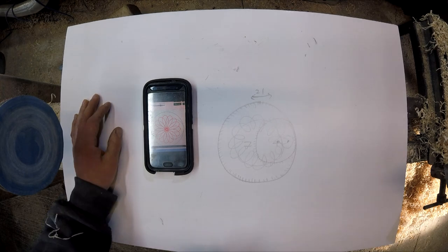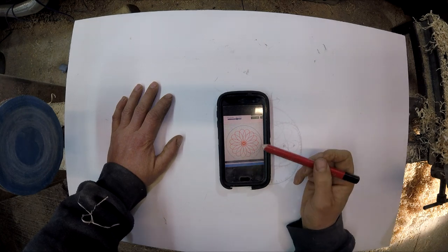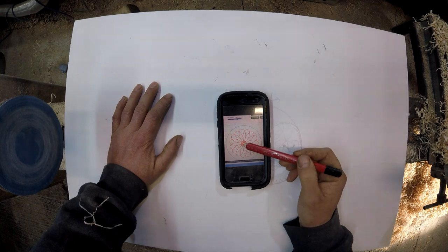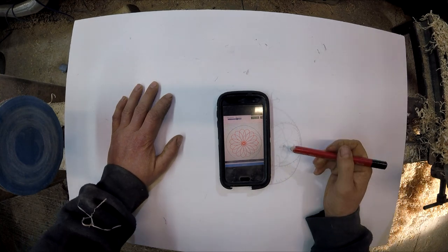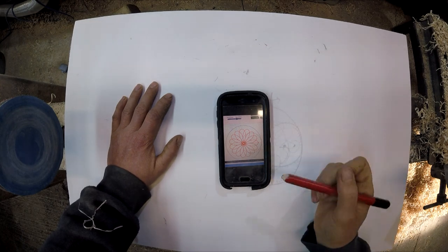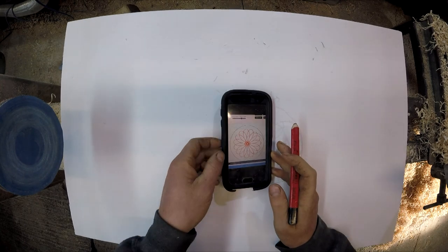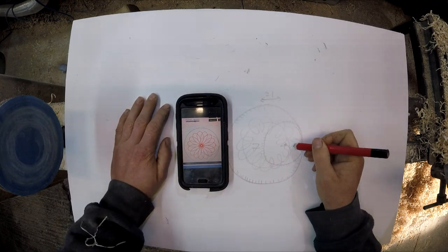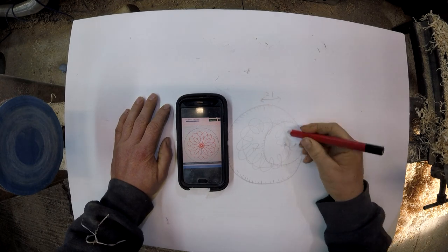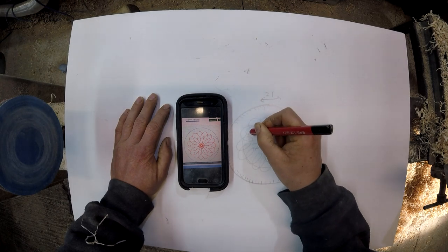There we go, beautiful. Now, if we look at this, this ratio of 4 to 7, and depending on where that hole is, gives you this beautiful flower motif. And the idea is that I'd route out this channel, and then I'm going to fill it with epoxy and make some wonderful colours in there, and then I'm going to change the position of this hole to one that's closer to the centre, and that's going to give me this pattern more elongated around the centre.